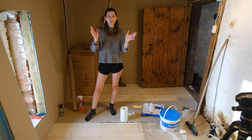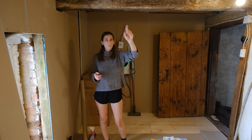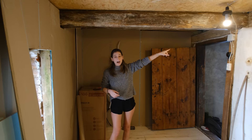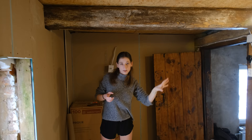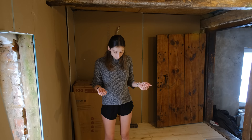She just loves this wood. The next day we decided to paint this beam, not the other one, because with that one we're not sure how much we're keeping and how much we're replacing. That's why we didn't lock it. But this one is staying. We noticed that this beam goes all the way till the end of the house — it's all one beam, pretty nice and solid. It's mostly the outside layer, maybe a few millimeters eaten by termites, but the rest is really nice and solid. It's way too big a size, so even if it has a centimeter eaten all around, it's still strong enough. It's not going to have the clay like it used to, so it shouldn't have too much pressure on it. We kind of solved the floor issue pretty well — we'll see when we lacquer it, because lacquer really brings things out.